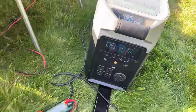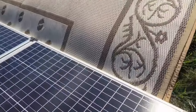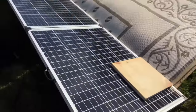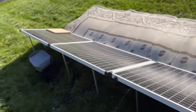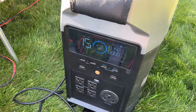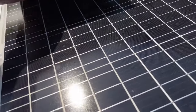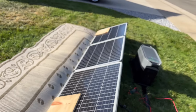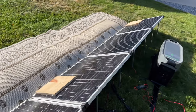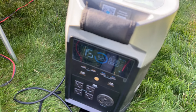About 260 watts now. Let's put this block back down — one panel has been affected and we've lost about 50 watts. If this were series-parallel, we would have been down to half. Now let's grab this block and put it here too, so we have two panels blocked. Remember, in series-parallel this was a zero-output configuration, but in a parallel configuration we still have two open panels giving us full power — about 75 watts each. And moving the block to a different spot doesn't change anything, because each panel operates independently on its own.